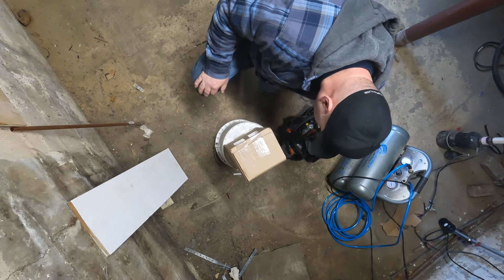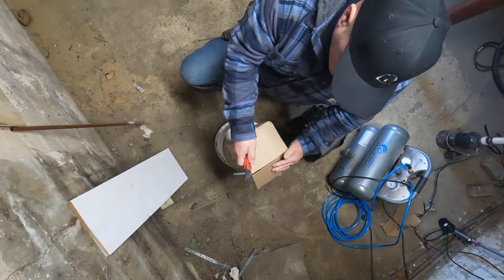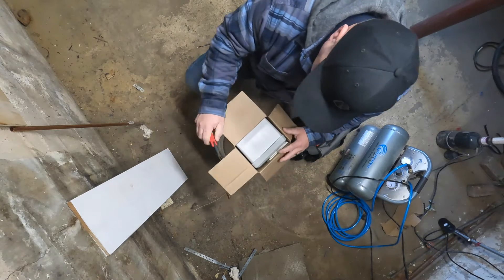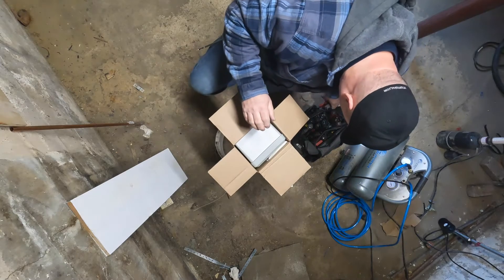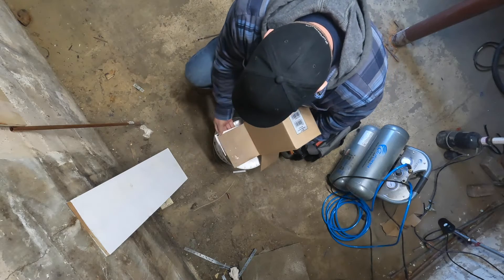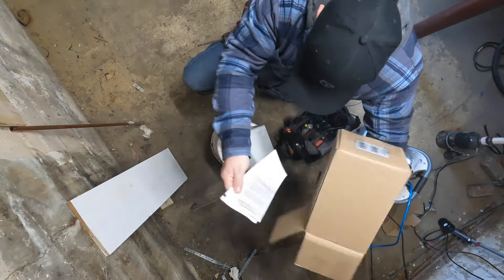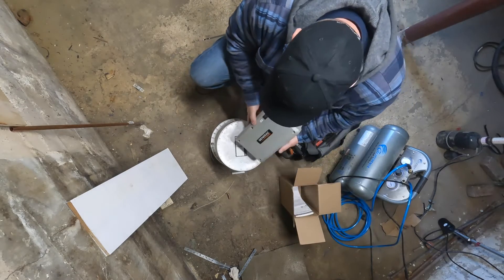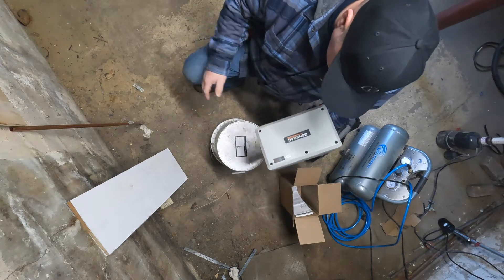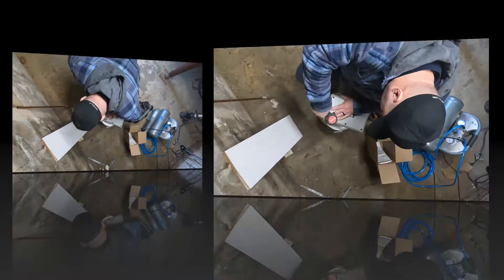The largest electrical load in this house is the air conditioner condensing unit which sits on the outside. When it starts, it draws four to six times the amount of current it uses once it gets going. This is known as an inductive electrical load, and sizing the generator properly goes a long way in being able to use that condensing unit. That condensing unit is wired to a set of contacts in the 200 amp main breaker automatic transfer switch, and when the generator does not have enough power to start it up, it opens a set of contacts and prevents the air conditioner from starting.